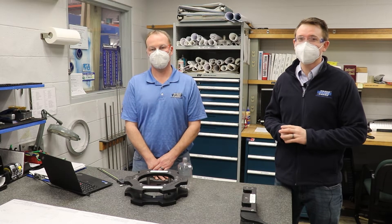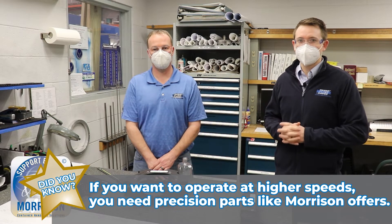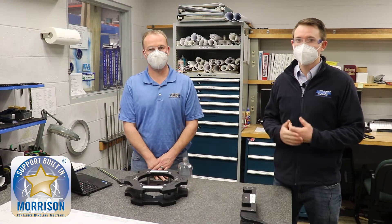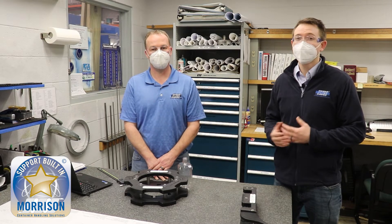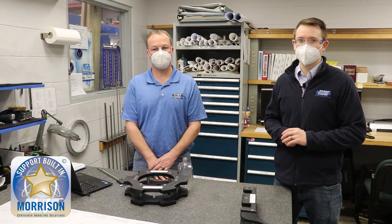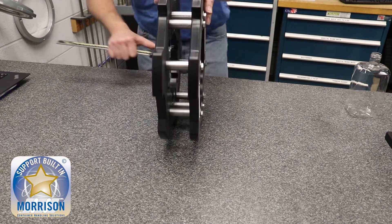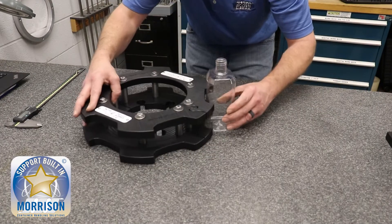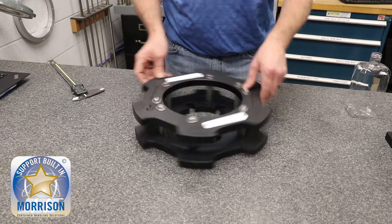Here we are in the inspection office at one of the last stages of our change part manufacturing process. We're in a temperature-controlled room, and why that's important is because most of the parts that we utilize — because of higher performance and wear qualities, especially in caustic environments — is UHMW. UHMW is a material that will expand and contract a little bit with different temperatures. When it gets hotter it has the ability to expand slightly, and when it's colder it shrinks a little bit. So keeping it in a temperature-controlled environment makes sure that we're measuring and inspecting it at the ideal levels that will simulate your manufacturing plant floor. Things that we're going to be highlighting here are the different deck heights to make sure that the contact points on your specific container are ideal and correct, making sure that the bottle fits correctly inside of the part itself, and making sure that the name tags and numbering schemes are correct so that when you get them in the field you can identify them correctly and easily.